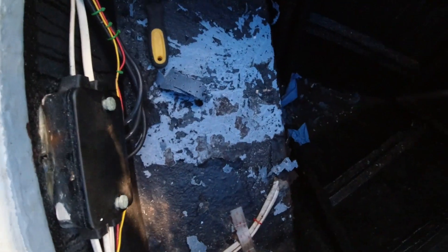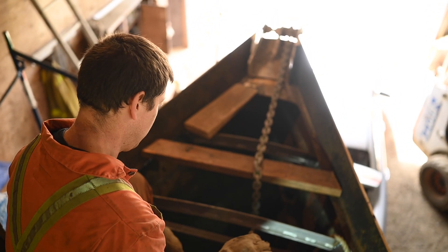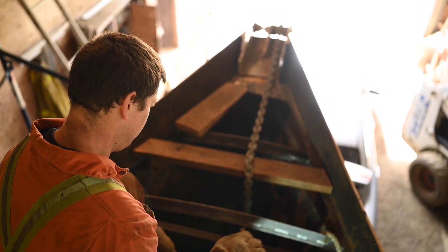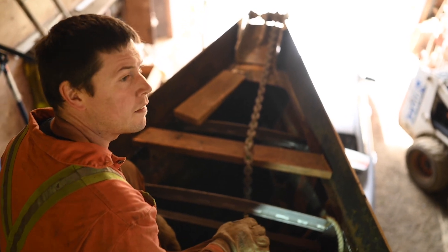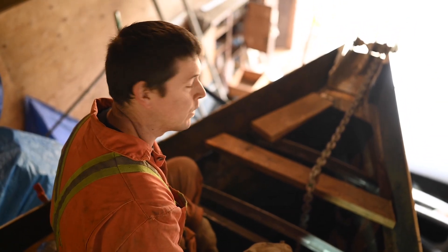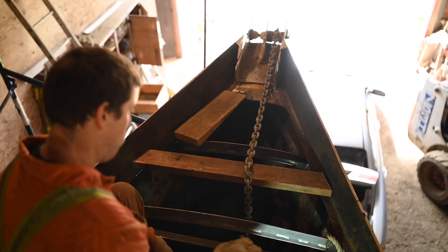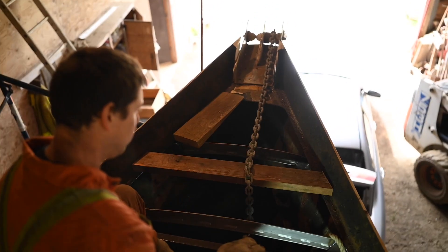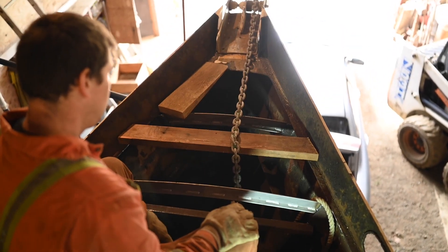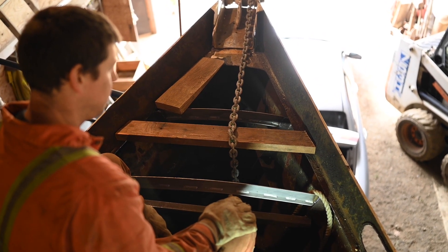And with how deep the locker is, we knew at some point we would need to get in there. The next thing we tried was putting the windlass as far forward as possible and creating a spiraling pipe. But we have just discovered that we don't have enough depth in the chain locker to actually make that feasible — not unless we cut our chain in half, which we're not doing. So we are currently trying to figure out how we can get the windlass back farther without having an issue with our door being non-functional to actually get into the locker.